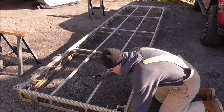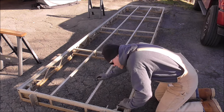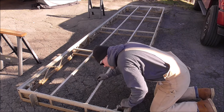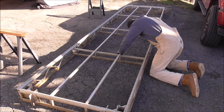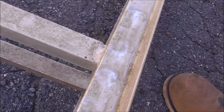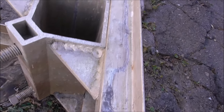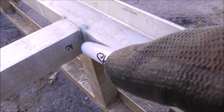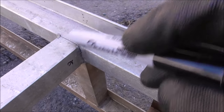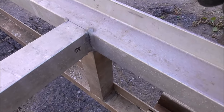I'm just turning it over so I can find any other spots I couldn't see when it was upside down, so I can fix everything while I have it up on the sawhorse. Just going down it inspecting everything, making sure I don't miss anything because now's the time to fix it. You can see this is a bad one right here — I'll get a little X on it. I might even grind this out a little bit, V it out, weld it, and then grind it flush to get a little more weld in there.